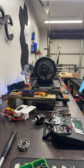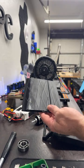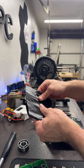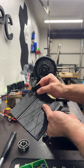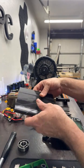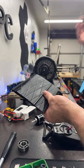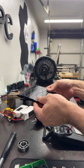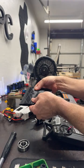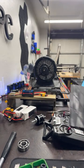And I have all the wing pieces for it. Like, here's an example of one of the wing pieces out of the AMS TPU. So you get that organic flow in the ailerons, and that's kind of what I'm going for. And the wing will take a 4 millimeter spar. It is roughly 1,000 millimeters. So it's going to self-dihedral as well. So that'll give me a unique glider to kind of play with.